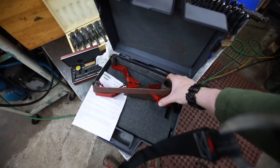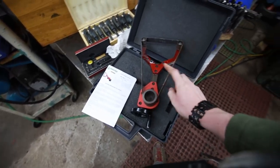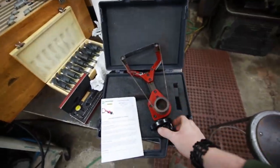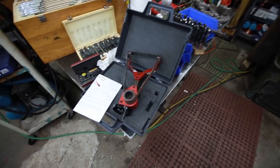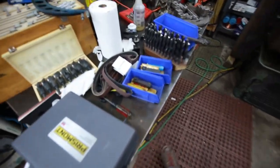An indicator for my mill here. And then this guy here — actually my buddy that's a machinist told me I needed to buy this because at first I was like, what the hell is that thing? Basically if you are cleaning up a part on the mill instead of holding some sandpaper on it, this thing mounts in the tool holder and you crank this handle here and the sandpaper moves along it and it will cope to the part you're trying to clean up. He said basically, buy this so you don't injure yourself. I'm all about saving my digits, especially since learning that guy got his hand wrapped up in a milling machine and the end mill ended up milling off this finger here. It sounded really horrible, looked nasty — way worse than what I did.